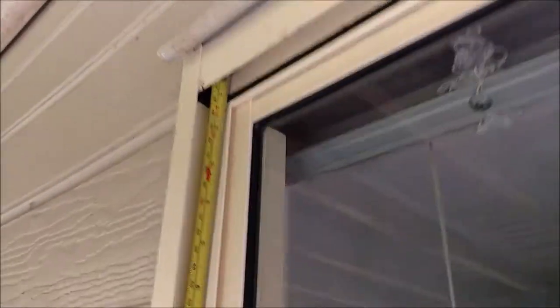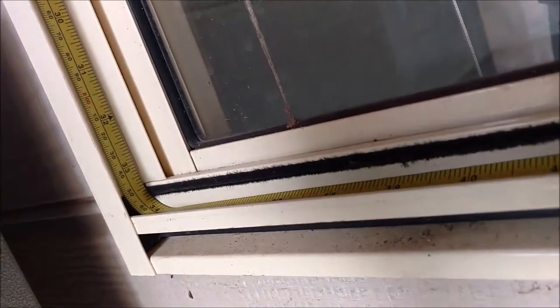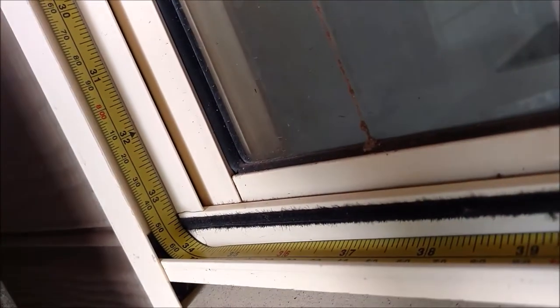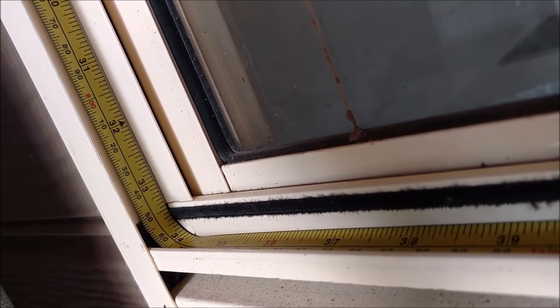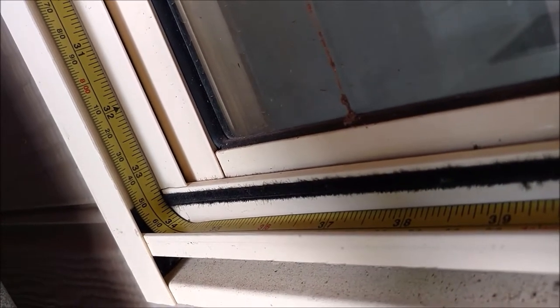You can measure your window frame — insert the measuring tape at the top, line it down the length or across the side, and into the corner. Mine's measuring at about 850mm; if I go right to the end, it's 860mm. I've been cutting at 850, or you could probably cut at 855 to allow a bit of movement to be able to get the screen in and out. Then you do that across the side as well.